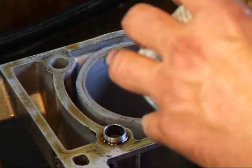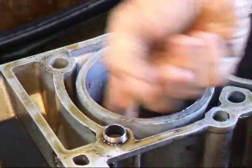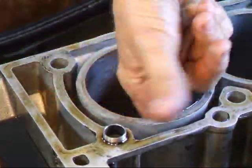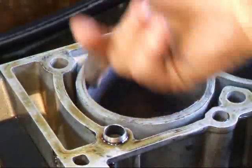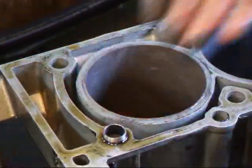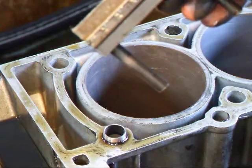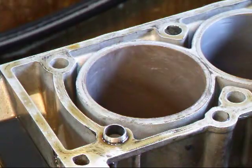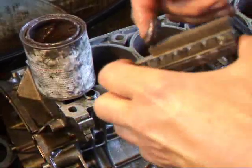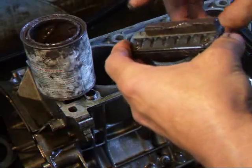I'm going to apply a special compound to the cylinders in a nice thin layer — it's a little messy. Then we're going to use a felt that has been soaked in MAN 845. The last thing I want to do is put a little compound on the felt brushes here to load these up.